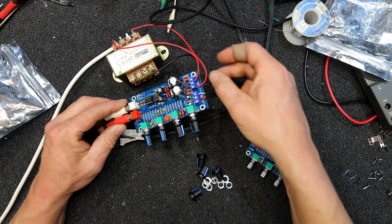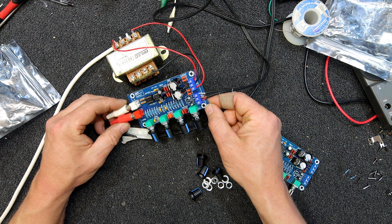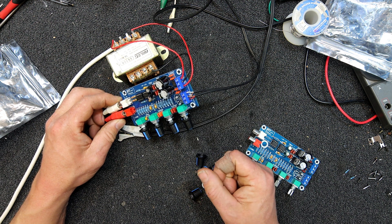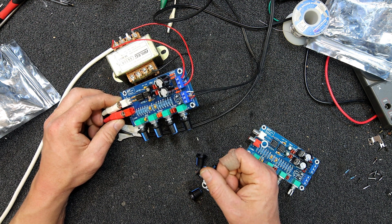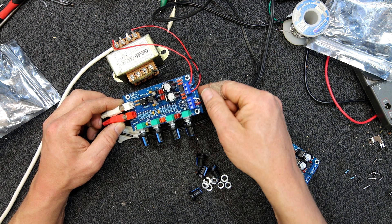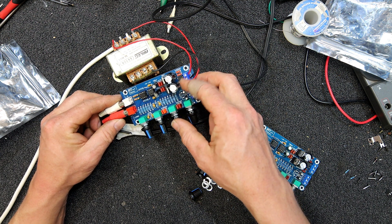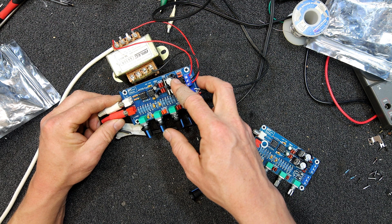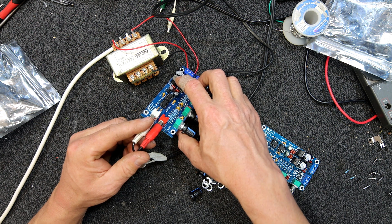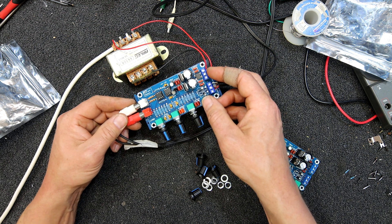You run your 30 and zero volt leads to the two AC terminals. If you've got a different transformer like the Jaycar toroidal, you obviously put the centre point into the ground and the other two should be the 15V AC leads relative to that — but it doesn't hurt to check. You want whatever pin goes into the ground terminal to have 15 volts AC to each side. You can go higher, but 15V AC is enough because it comes out at about 22 volts DC once it's bridge rectified and filter-capped.